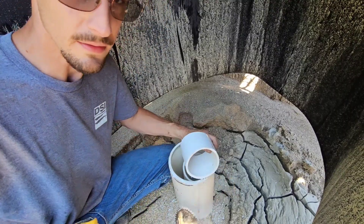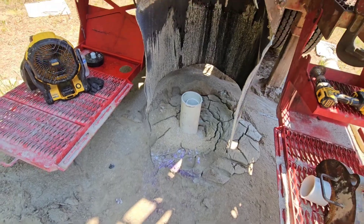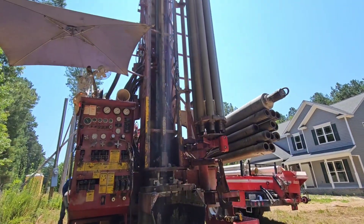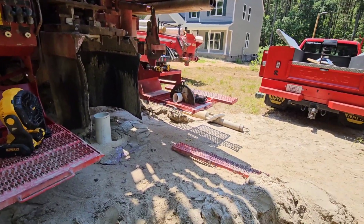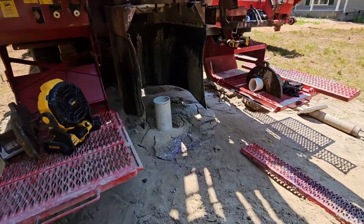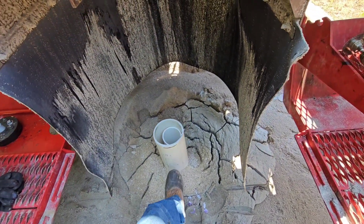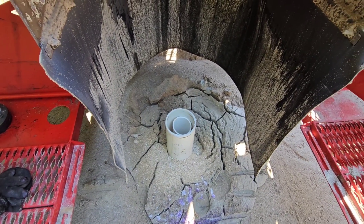Just like that. Hot dog. Good deal. We've got the gravel in there and everything's set up. What we have to do now is tear the rig apart and lay it down. We'll be back in a few weeks to hook up a pump — this one's going to get a three inch submersible pump inside the four inch slotted sleeve. We'll write all the notes on the side of the casing so we always know that well's got a slotted screen in it, not a liner.